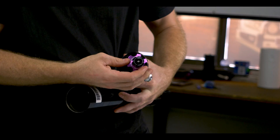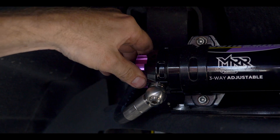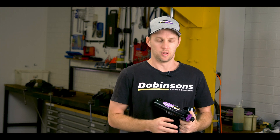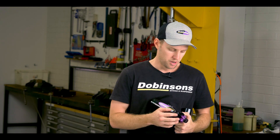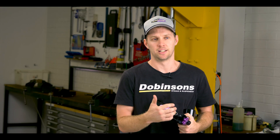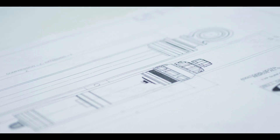Looking at the compression adjuster, we went through around 15 different revisions to get something that we were happy with. There were quite a few criteria we needed to meet. We wanted to make sure we got nice pressure balancing across the different chambers in the shock — not over or under pressurising different chambers, which can give undesirable effects. We also wanted a really nice adjustment range, with adjusters that move evenly and smoothly, and that work in conjunction with each other so you get separate adjustment on both without affecting the other path too much.